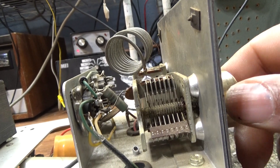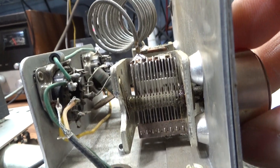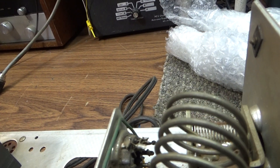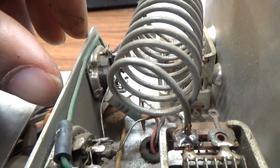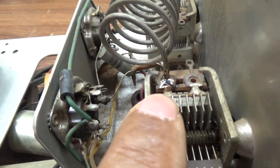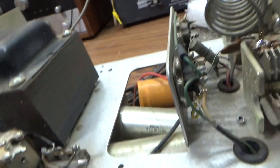Those harmonics hit the tune and load caps, and that extra voltage and bad signal kills them. A lot of times you can see an arc or burn mark on them, or as you're turning it you can feel a soft spot, hard spot, or a catch or glitch. This one seems okay. One thing I did find with this one — I just got it, opened it up — and this tank coil here was completely disconnected from the tune cap. So we put some extra solder on it and soldered it up, and everything feels nice and solid now.